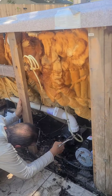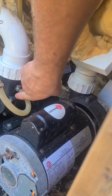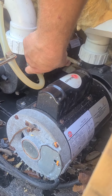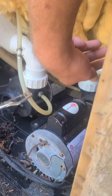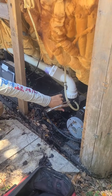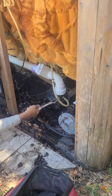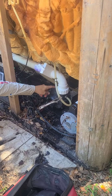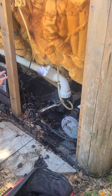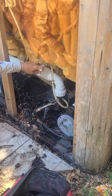I tried to take this off in the whole priming process and it looked like when I started taking it off, it was kind of starting to crack down there. See it? Well, once you get this thing under pressure, if there's a crack it'll start leaking. It wasn't dripping right now, but I was just figuring it could be something in the future. I can always get a new fitting for this — that's what they call this piece — like a new union fitting for the pump.